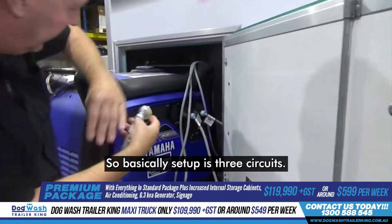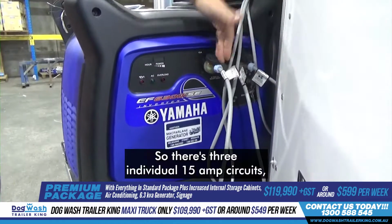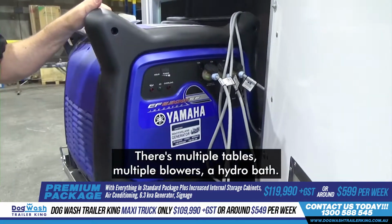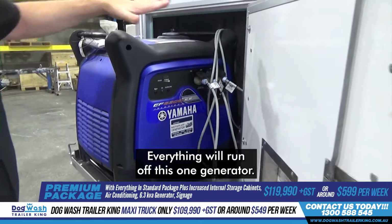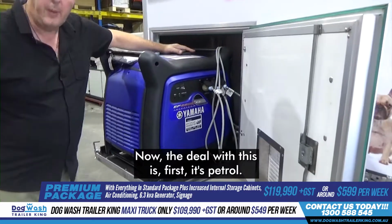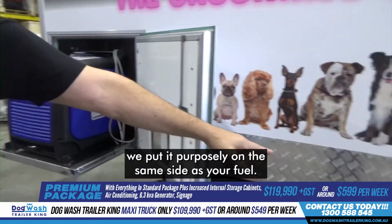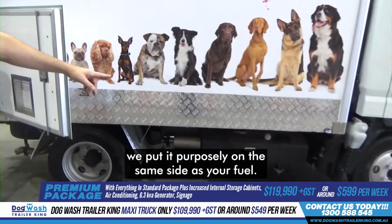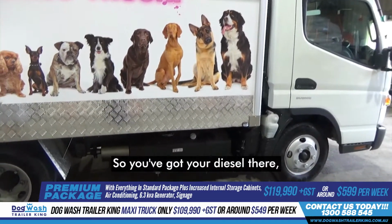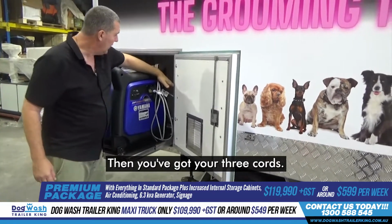So it's basically set up with three circuits, okay? There are three individual 15 amp circuits, and I'll show you inside, there's multiple tables, multiple blowers, a hydrobath, everything will run off this one generator. Now, the deal with this is, first, it's petrol, so it's nice and easy to fill up. If you're around at a servo, we put it purposely on the same side as your fuel, so you can be at the servo and literally fill up at their bowser. You've got your diesel there, but this is petrol, right, which is no big deal. Then you've got your three cords.